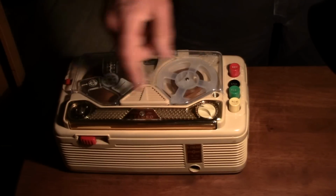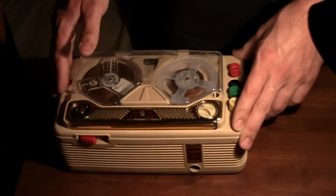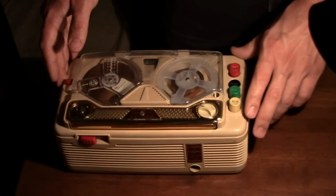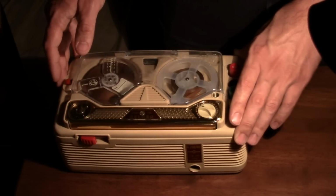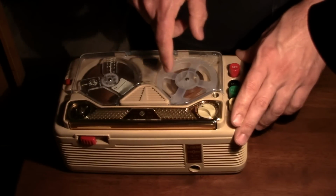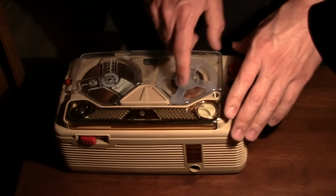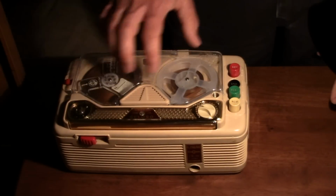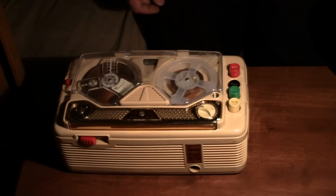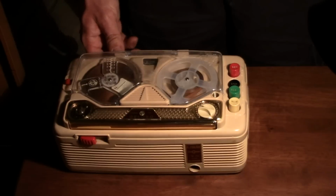And the very culprit of that bad design is evident in this recorder in the fact that the pinch roller does have a notch. It does run surprisingly well on this tape considering the fact that it has a notch, although it is picky on which tapes it will work with. When I first got this, I tried it with an existing tape I had to use for some testing. I think that tape had 1 mil thickness, and the tape would run through one revolution of the pinch roller, then stop. I had to give it a little push, and then it would run through another revolution, then stop, or I could just keep on giving more torque on the take-up reel to keep it running. But thankfully, with this 0.5 mil tape, it seems to be running the tape surprisingly well, considering that there is a notch. And the music, of course, sounded like it was overdriven a bit, although it didn't look quite overdriven on the meter. But then again, I'm not sure how accurate that meter is.